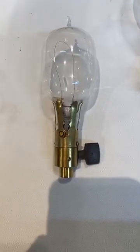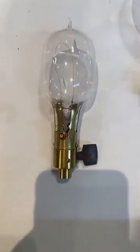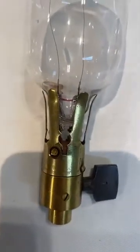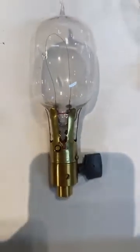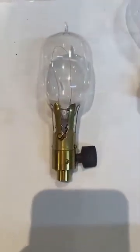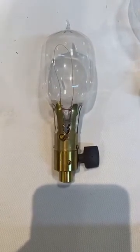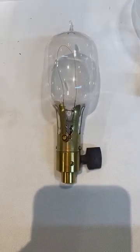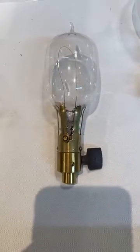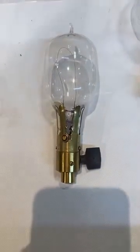The very first Thompson Houston lamps were baseless. And they are characterized by this sort of squarish shape, as well as a red glass, sometimes seen in blue, divider in sort of a V shape with a red glass divider separating the lead-in wires. The socket is as shown in the 1886 Thompson Houston catalog. The socket turned up separately from the bulb and was assumed to be European. However, it matches the Thompson Houston, and it is a Thompson Houston socket for this bulb.